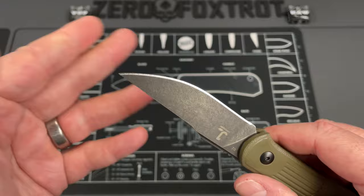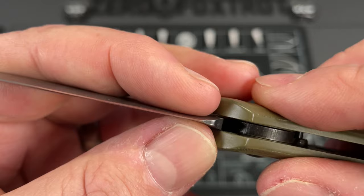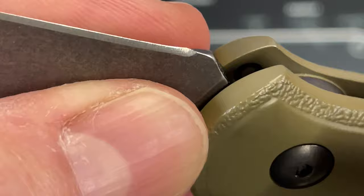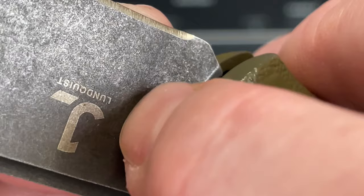So as you're sharpening, you're going to have a weird tip. If you're using a fixture system or even stones, you're going to take more material off here and you're going to have to be real careful about how you do it. And with the grind, I'm not a fan of the plunge. I wish they had just brought it all the way back or added a sharpening choil — just take this material out and bring it to here. I think it would have made it a lot easier because you're going to wind up with a smile, and when you start sharpening, you're going to slam that into your stones and chip it. You can see here where the plunge actually ends — that should have terminated further back and been brought all the way forward.